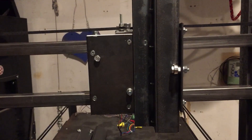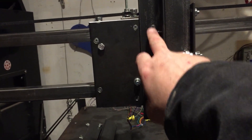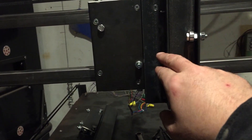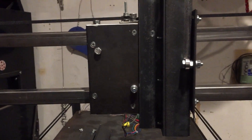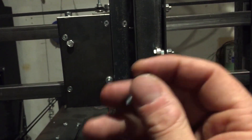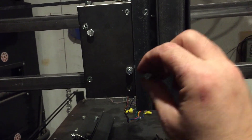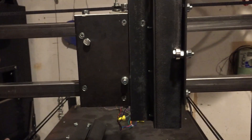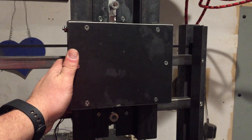I'm temping in the first rail for the z-axis. As much as I'd love to use the flathead screws we've been using, if I did that on all four or six of them, this position would be locked in place permanently. I want to leave myself an out for adjustment, so I'm going to use a pan head screw and overbore the hole slightly - just the one inside the rail - so I can make adjustments and tighten it back down.